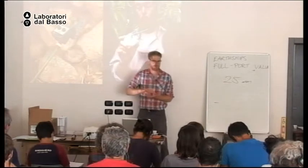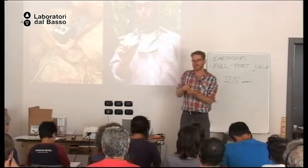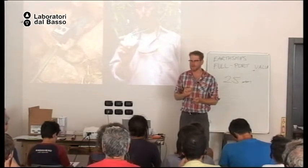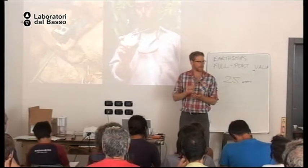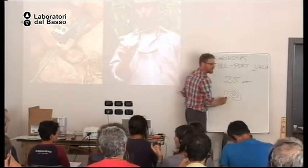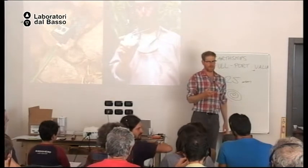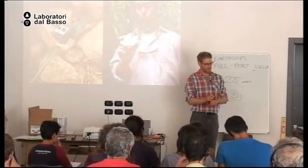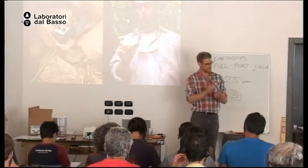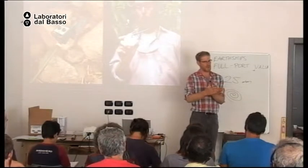So you need to get a spring-loaded timer, a timer that is like this. It's a spring so that the tension of the spring will turn off the timer, okay? Not a clock. Does that make sense? When I say spring, I mean a spring like that. Okay. So, a normal drip irrigation timer works on a clock. But it also has a sensor. And if it senses that the pressure changes a fair amount, it will either shut off or it won't shut off, because it's used to a regular pressure.